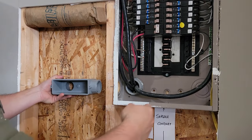Now that I have the house wired and I just gotta add those four connections, I do need to work on adding a plug and a light out here in the building, because to get my inspection approved, I have to have at least one plug under a GFCI. I'm thinking about just doing an arc and ground fault breaker. Yeah, they're expensive, but I can have one and run that whole series out here in the garage. I know I have to have a GFCI by code out here, but that's about $60 for that one breaker, and that's a 20 amp, but I'm thinking about doing that.